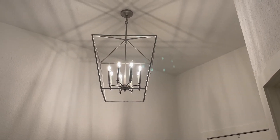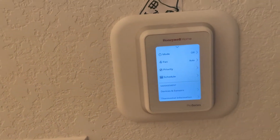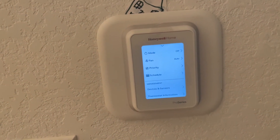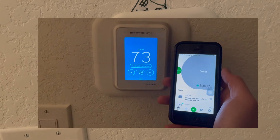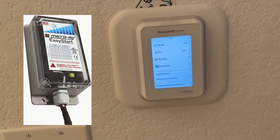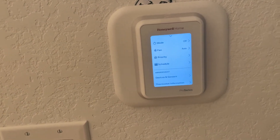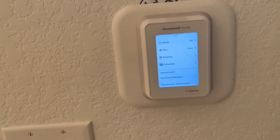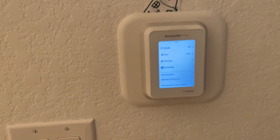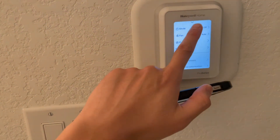Let's go inside and see if the lights are on. As you can see, we are able to power the house from the generator — here are the lights on. The most important thing I want to do is get the HVAC working with the generator, but unfortunately that didn't go so well. When I tried doing it, the power went out. So I'm probably going to have to install a soft start system, which reduces the inrush when you're starting the compressor from idle — that takes up a lot of electricity. I'm going to look more into that and post a video when I do. Right now I'm showing that we are powering the house — we're doing around 637 watts.